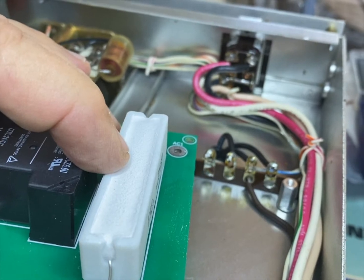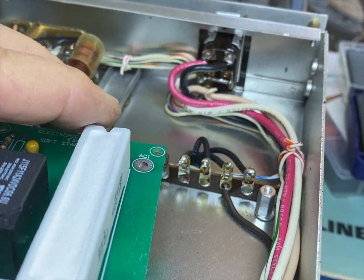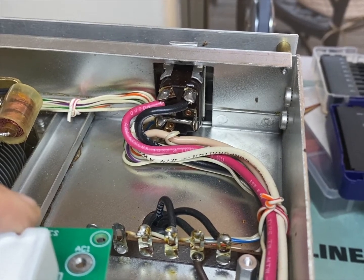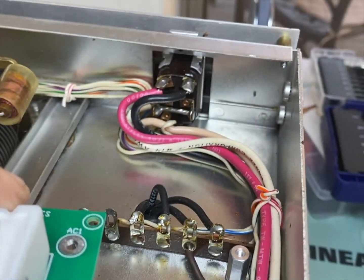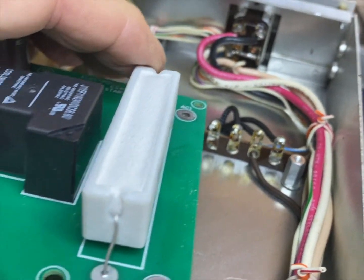And then the relay clicks, and by that point the tubes are already, I don't know, 70% warmed up, and the switch is already switched, but it's switched to lower voltage, so it's more likely to last longer, and that's the whole idea. So I've been anxious to do this, because every time I turn on my amp, it's like, is that the last time that switch is going to work?